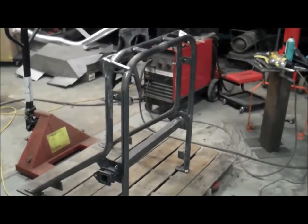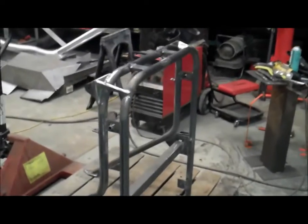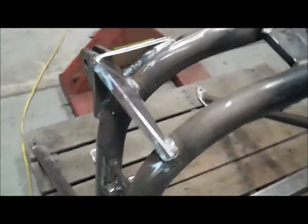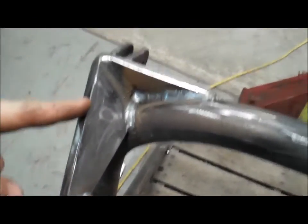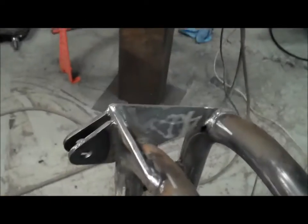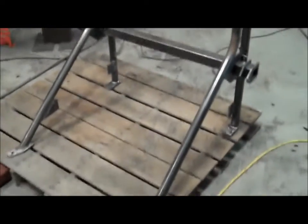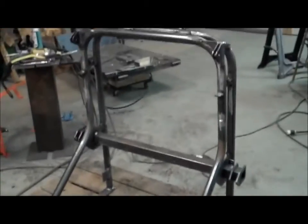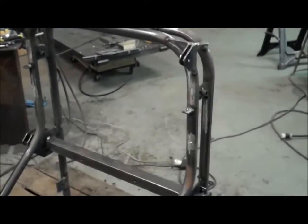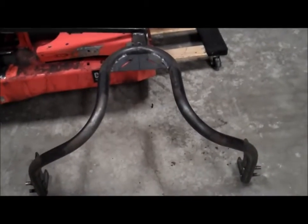Okay, here is the safety bar roll hoop that mounts onto the ramp. So the safety bar hoop comes off of these top corners. One thing you'll notice here is I added this triangular gusset right here that ties this corner back to both tubes. So I did that on both sides right there. And then I've got everything else fully welded on this hoop. And it's ground, got all the weld spatter off in all the critical areas, shined it up nice.